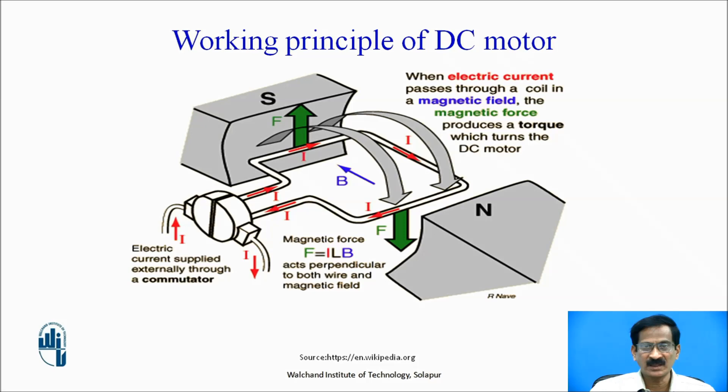The flux from the permanent magnet is in the form of straight lines, and there is an interaction of the two sets of flux — one straight line flux and another circular flux. On the side of the conductor where these two flux sets are unidirectional, a force is exerted. In this way, on the two sides of this single-turn coil, forces are exerted exactly opposite to each other, shown by green-colored arrows, and in this way the coil starts rotating. As the coil rotates, the polarities of the coil position change and simultaneously the direction of current flowing through them changes.